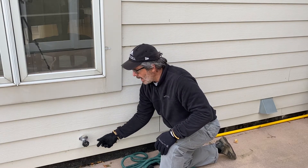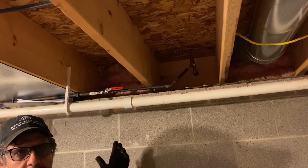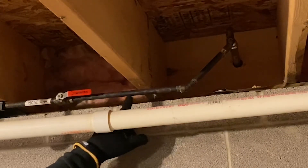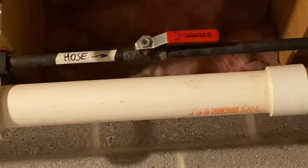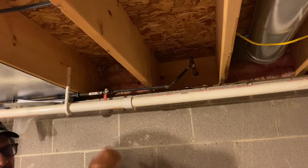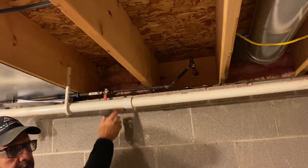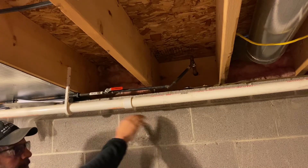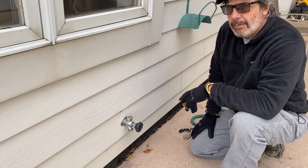I'm going to go inside and shut this off. You want to find where your hose line comes into your house for the shutoff. I have a basement, so I look where my hose is coming in — comes down here. This one's easy because I marked it 'hose,' so I know that's my hose shutoff. I just reach up and pull that lever down. When the lever is in the down position — looks like an L shape — that's off. When it's in line with the water line, that means it's open. That's off, so that one's done.